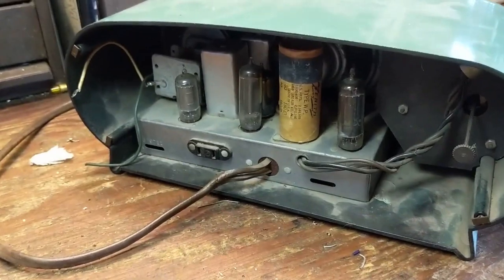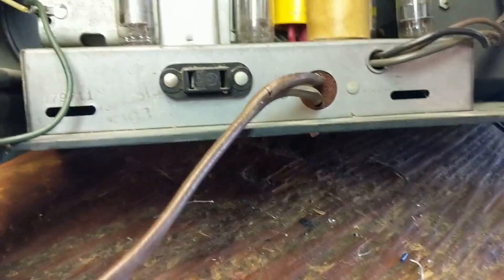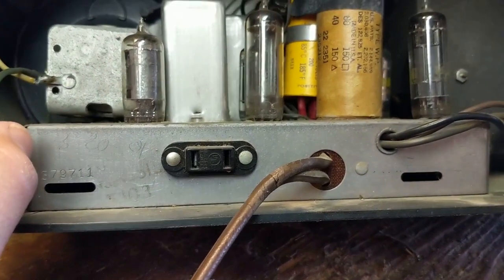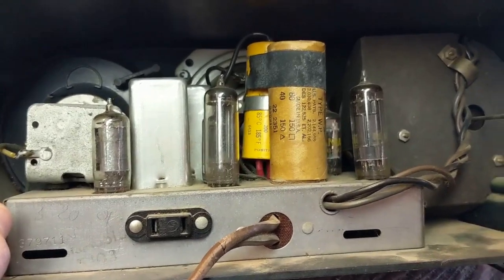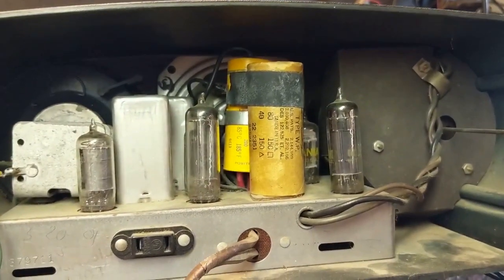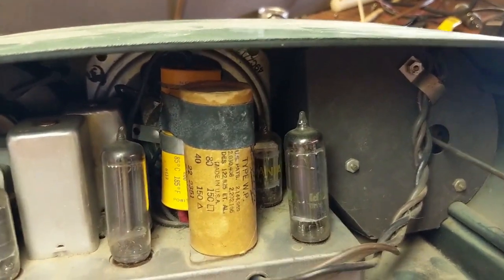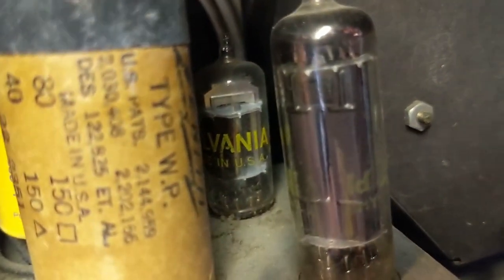It's kind of unfortunate that it's missing the back. What I'm probably going to do is install a ferrite rod. I've got a note on here: 52001 — that surely can't be the last time it was worked on, that's way too recent. It's a typical five-tube set — we've got probably a 35W4, either a 35 or a 50C5, a 12BE6, a 12BA6, and a 12AV6 up here — that guy with the aluminum stuff coming out of the top.